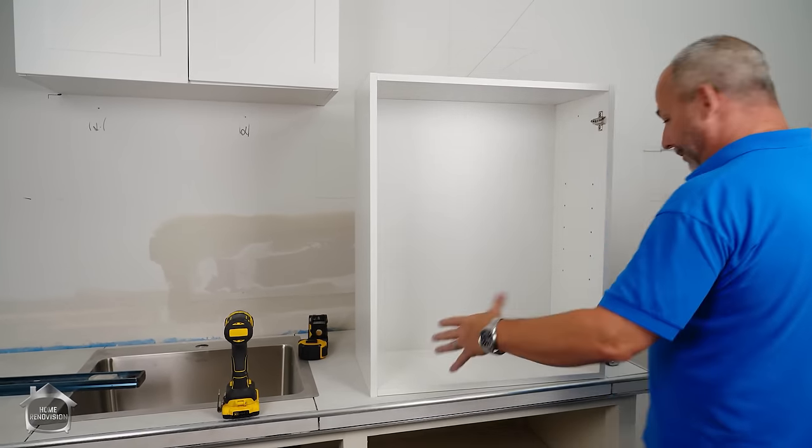So the way we fix this, we leave the clamps on. I literally have to undo that screw, and we're gonna go right in the same spot, but what this does is it gives me the ability, okay, loosen that up, to pull this bottom cabinet forward, so I'm gonna shim it with my tool. Okay, and see that? Now I've got the ability to push it back. Okay, now I'm gonna finish throwing two screws in this before I sink that in again. And that is pretty much a process you go through over and over again, which is why it's nice to have those four screws in every cabinet. So you've got the ability to back off the tension, twist things around a little bit. This is what the secret sauce is in doing cabinets.